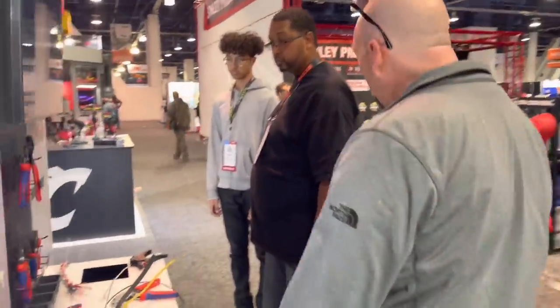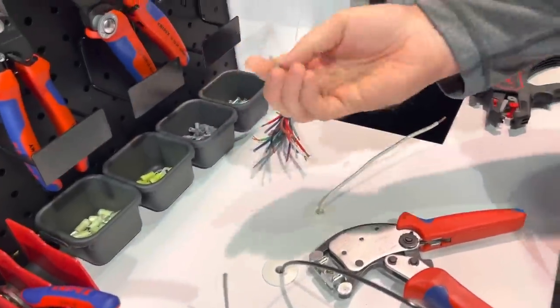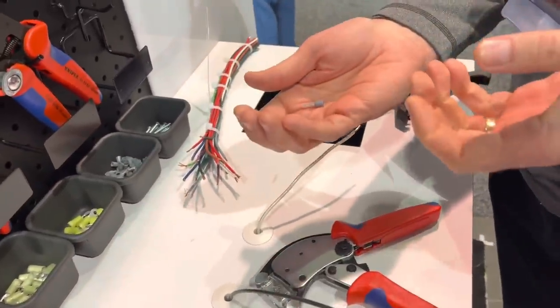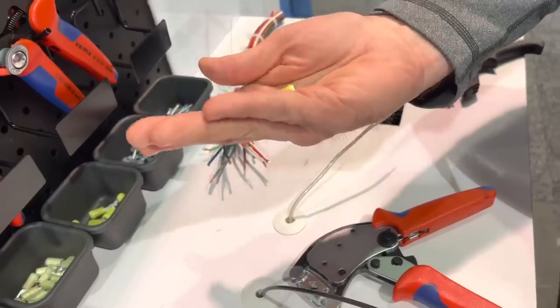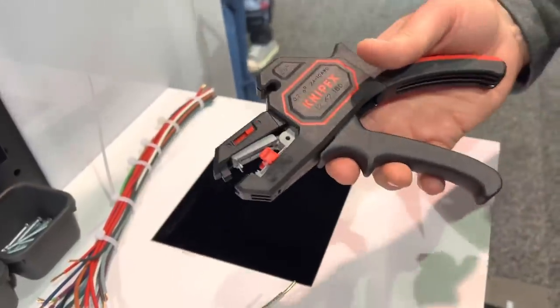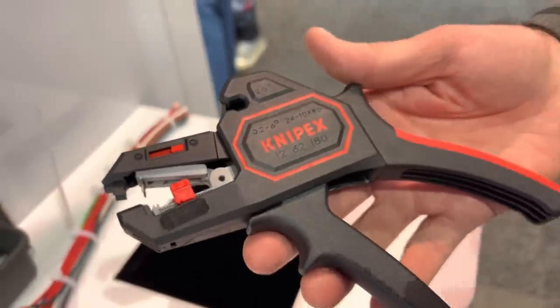So what are we looking at today? Teach us something. Stripping and crimping, all in that order. What I want to do is show crimping with end ferrules. This is starting to get really popular with the audio guys, especially on the amps and the speakers, because you get a nice tight crimp with stranded wire. I'm also going to show, just for demonstration purposes, some insulated rings. The tool part number is 1262-180.